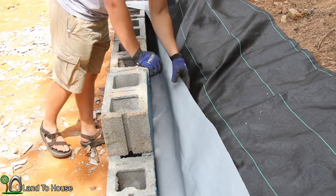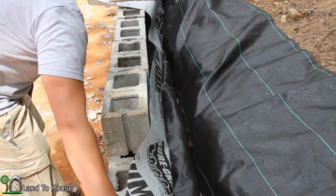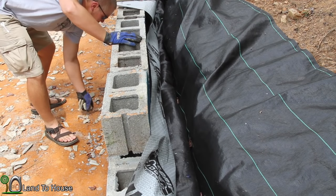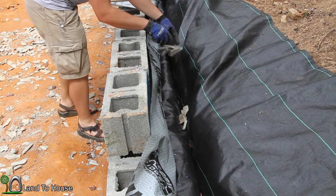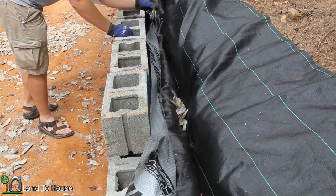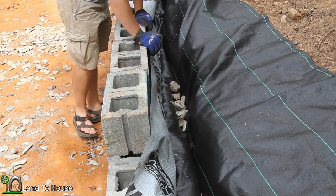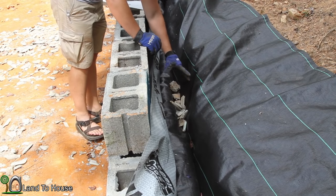Now, everything I have heard and read says that you've got to have something down between the silt filter and the underlayment here for waterproofing to help drain, like a drainage substance. And in my case, that's gonna be rocks. And when I chipped off all of these pieces of concrete, I think that would also be suited here to help drain in here. So I'm gonna pick up all these, probably rake them up, and then just set them in here. And then I'm gonna go around the property and find rocks of all various sizes and plop them in here. And I hear it's supposed to be a minimum of 1 foot of drainage in here. That way, when water falls in here, it hits the rock and can go out.